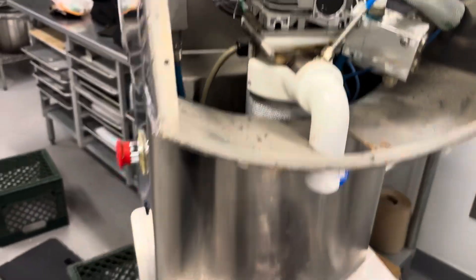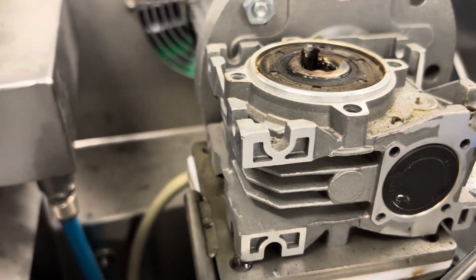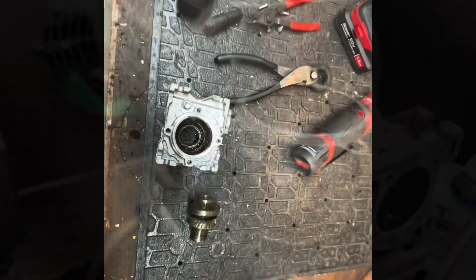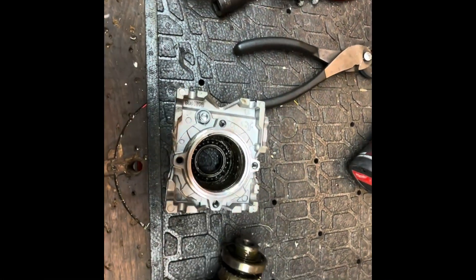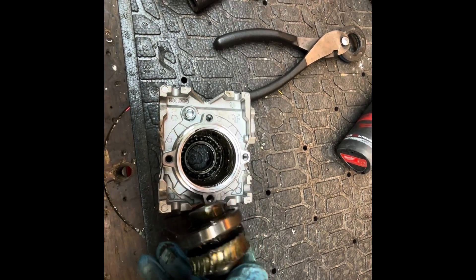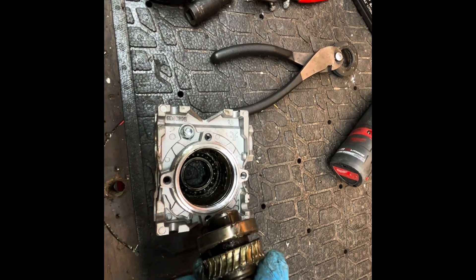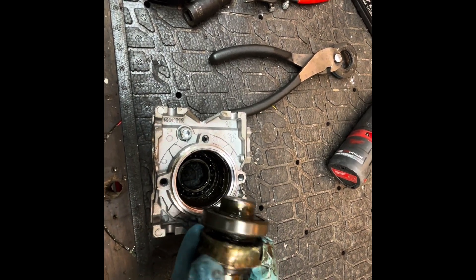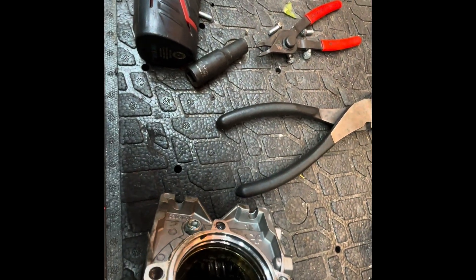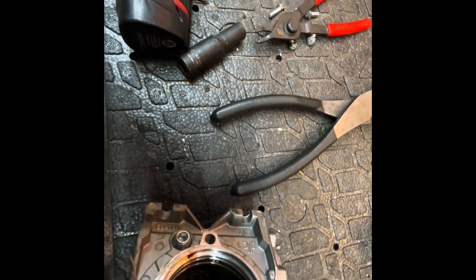On this Selmi temper machine the auger motor makes a clicking noise, so I believe this gearbox is fried. Here's why the gearbox isn't working — those teeth are just gone. There are barely any teeth left, and as you go around there are none. The worm gear seems mostly intact though.